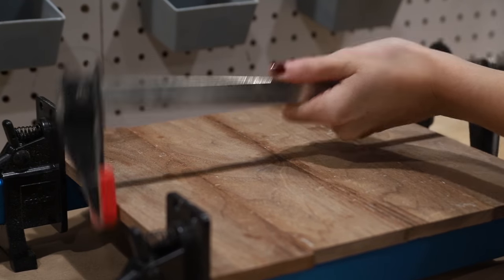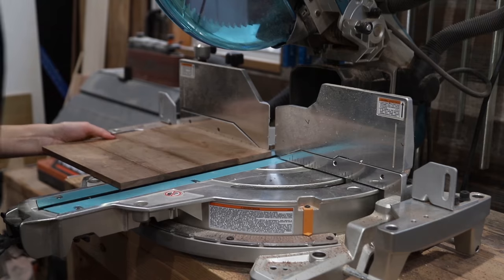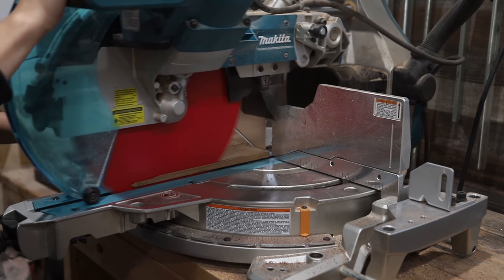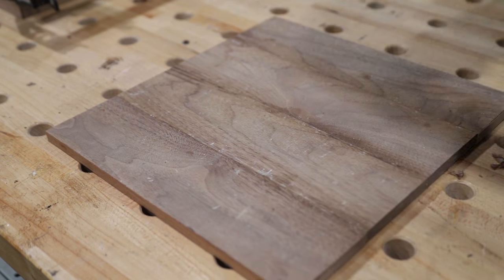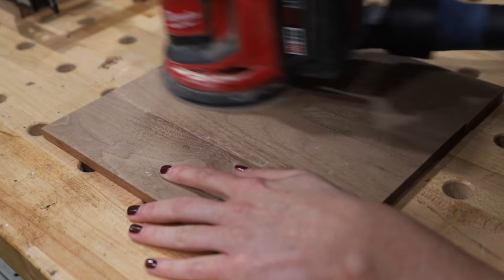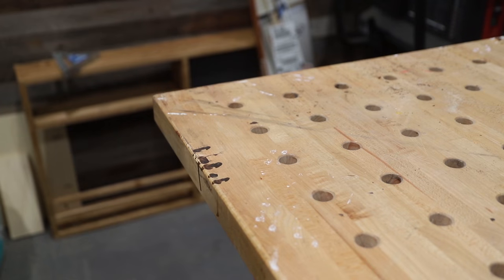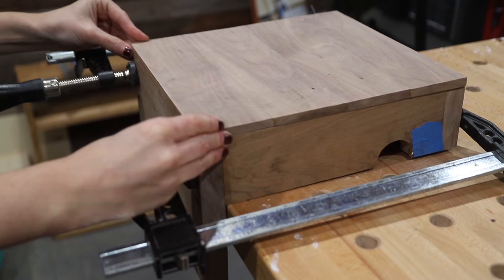Once that basic box shape of the bike hanger was assembled, it was time to unclamp the bottom panels. They'd been sitting for a couple of hours, were super dry, super strong, and I felt super comfortable using them for the bottom panel. I started by cutting them down to their perfect size on my miter saw, and once trimmed, I sanded them down nice and smooth. You can absolutely make a perfectly glued-up panel without a planer in your workshop — I have a video on my channel about making a cutting board without a planer that's super helpful.